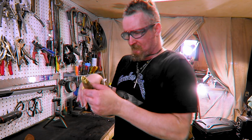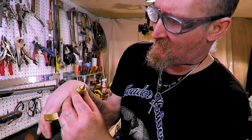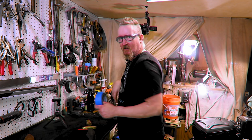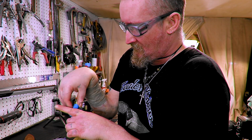So I think I'm gonna go on the horizontal grinder now. I was debating whether doing the bevels or do this, but I'm gonna take the end cap off. First, I wanna kind of draw around here, get it kind of straight. Then I'm gonna have to round it off anyway, but we'll see. Oh, I'm gonna tape this up before I take that off, cause I'm just gonna do the handle at first on the horizontal grinder, and then we'll see where we're going from there. Just in case the heat from that last part messed this up some, I don't want it moving while the pommel's off.